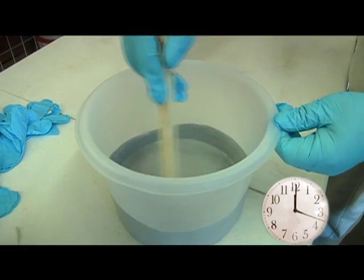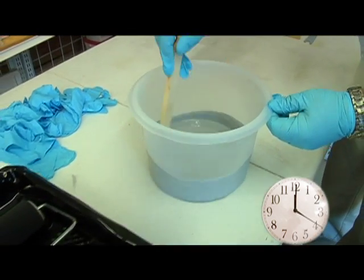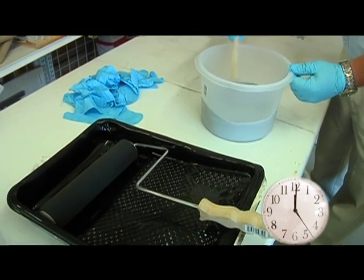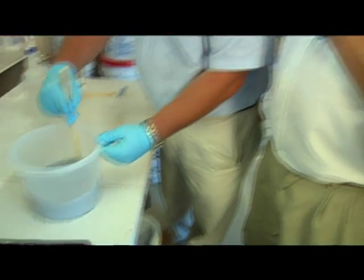You said we were going to put this down to what thickness of a layer? About 10/1000ths of an inch, or about 3 sheets of copy paper thick. Really? It's that thin? Yes. And that's the elastomeric part? It'll still be able to stretch and move and come back together? Yes. How did you manage to do that at such a thin layer? It's because there's no solvents and no water in the system. The chemical is a very tightly bonded chemistry, which allows it to stretch and come back.